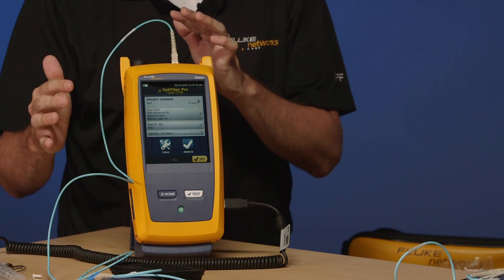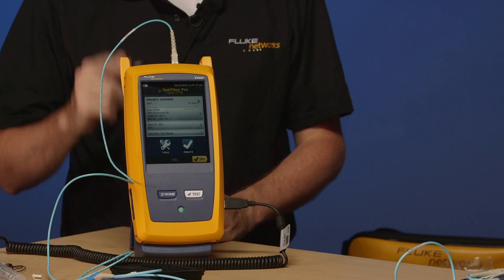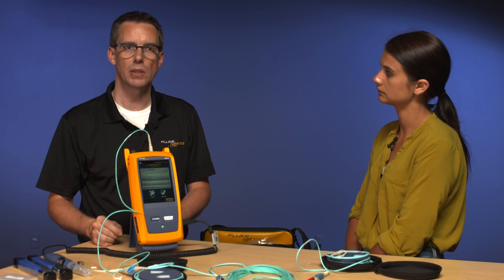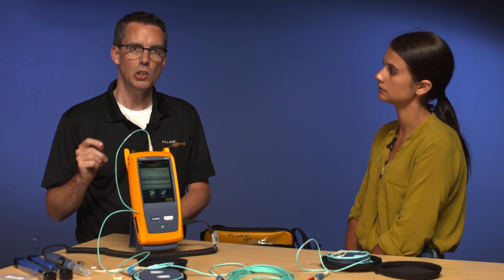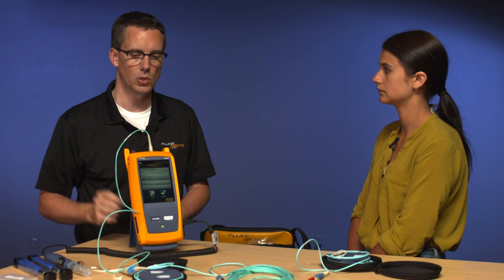I can do this because it's very short and it's within the attenuation dead zone of the OTDR port. You can never ever put a short cord on the end of the launch fiber to convert it from one connector to the next, because if you do that you're going to end up measuring two events as one and potentially finding a link that should not be failing. So this is okay, but never put this short cord on the end of the launch fiber.